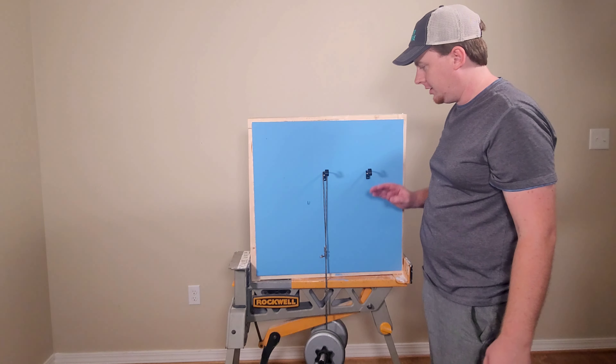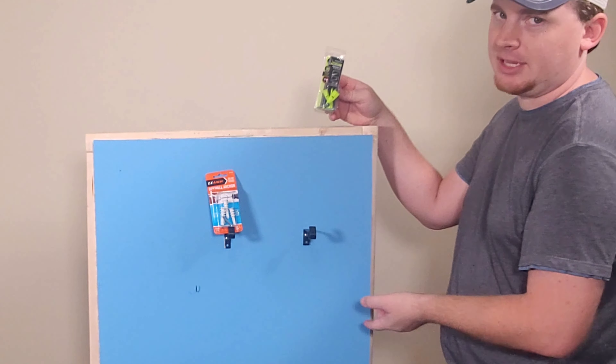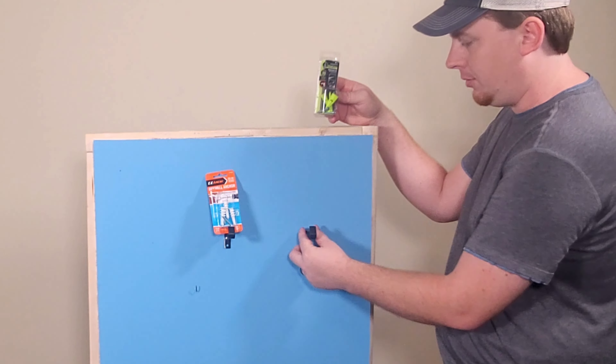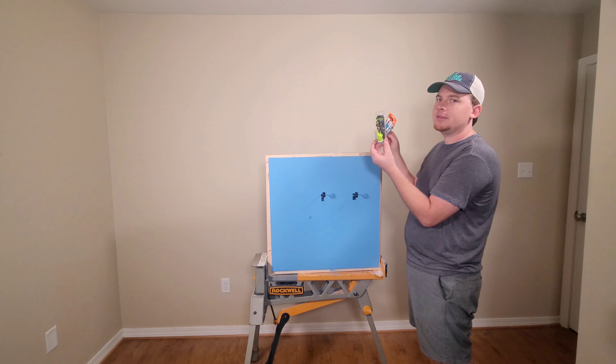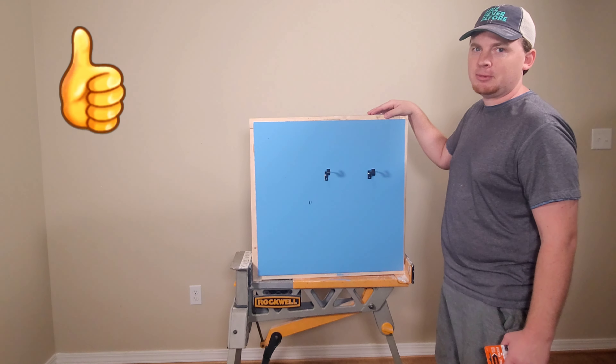After the weight test I inspected both anchors. The Wall Claw — the first one we hammered in — is loose after hanging 30 pounds, even though it's rated at 90 pounds and I didn't slam it in. It's still holding, but it's pretty loose. The Easy Anchor, rated at 75 pounds, is in there just as solid as before. So I'll be sticking with the Easy Anchor going forward. I just tried the Wall Claw for the first time and I don't think I'll buy it again. Hope you liked the video — hit that like button and please subscribe.